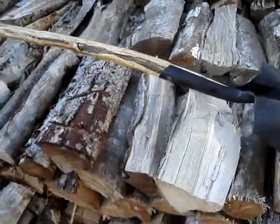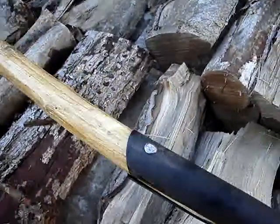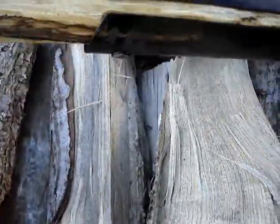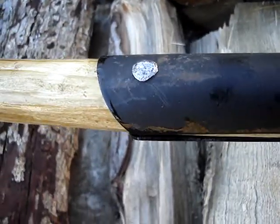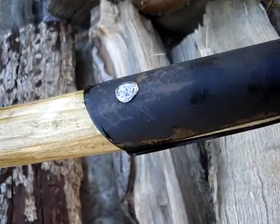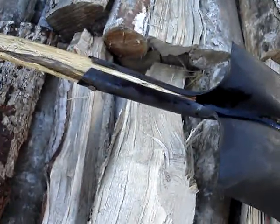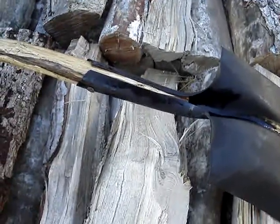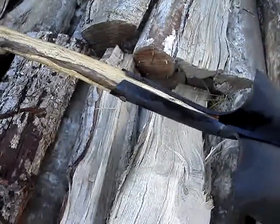I riveted this one on — I was thinking I'd have to bolt it, but the riveting job actually came out better this time. There's the nail head on that side, you can see where I beat it over. I just used a small ball-peen hammer and went at it slower, with the round ball, so it just pounded the metal and worked it out to the other edge. It's pretty good.